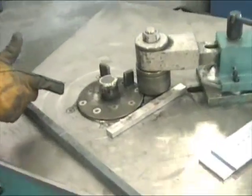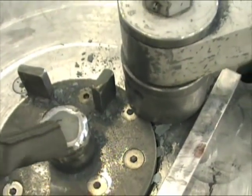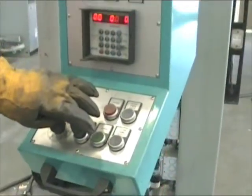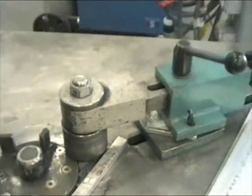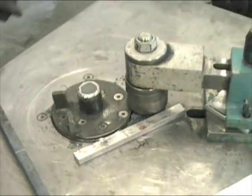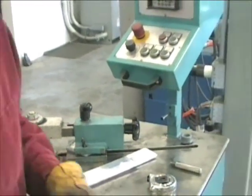This is a homemade fixture that we made just for your piece here. We've got an inch and a half mandrel here to push this thing around. We've programmed it so that we put the bar in here and it just bends it around. I'm going to do a sample piece and we drive it back to the zero spot.